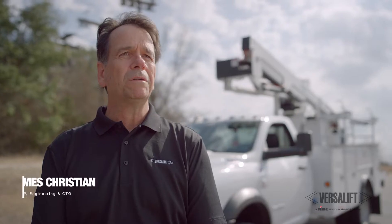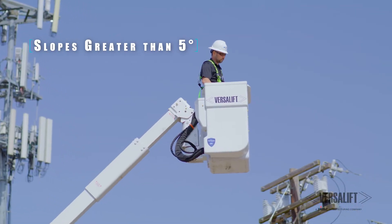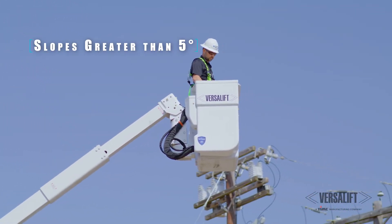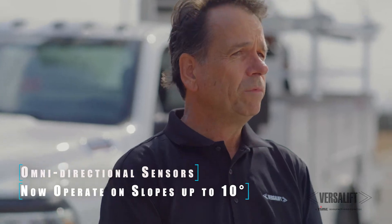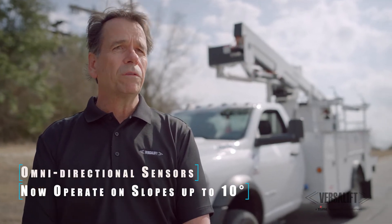Utility poles and telecommunication lines aren't just built on flat ground or five-degree slopes. The OSHA regulations say that you're not to operate on a slope that's greater than five degrees. However, we all know that you'll find power systems, telephone systems, any area where you're using an aerial man-lift, there are going to be slopes that are over five degrees. If you work on a slope higher than five degrees and the equipment isn't designed for it, you can stress out the rotation system and cause failure. So it really is a safety issue.